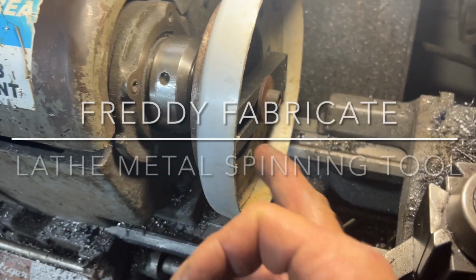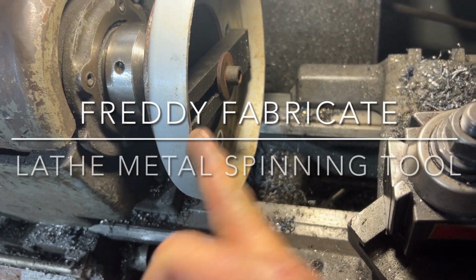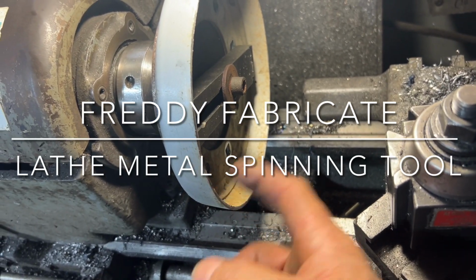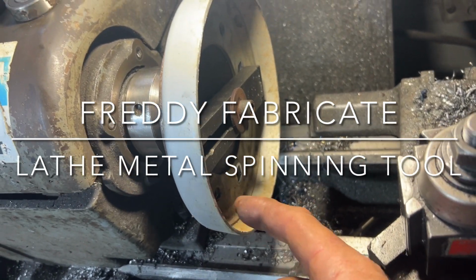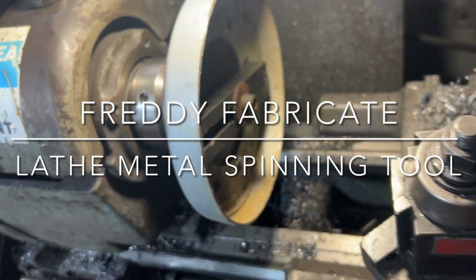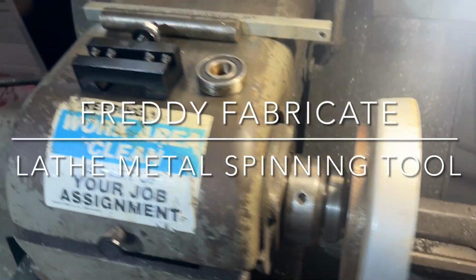All right, guys, we're back at the lathe. Here's the piece of the rim that I cut off. This needs to be widened about a quarter of an inch. So since it's a circle, we're gonna do about an eighth of an inch on one side pressing, and that'll equal a quarter overall.